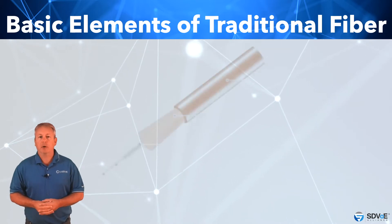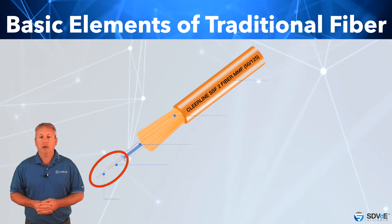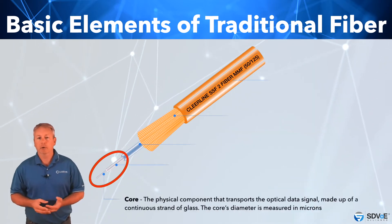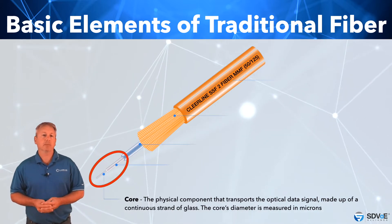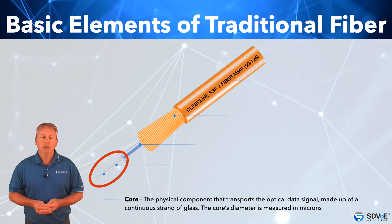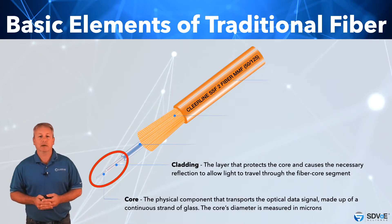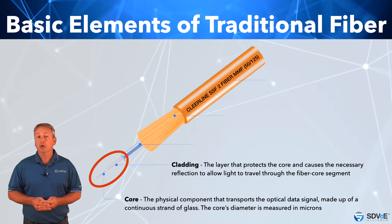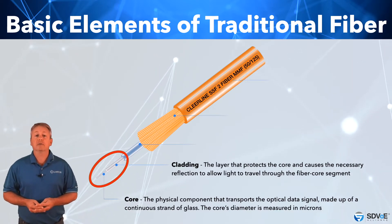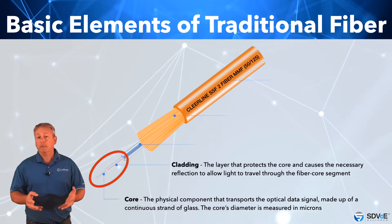At ground level, Fibre Optic cables are comprised of two elements: an inner glass core and a glass cladding layer around it. The optical core is the light-carrying element at the centre of the fibre, made up of ultra-pure glass via a high temperature process. The cladding layer surrounding the core is made of pure silica and has a slightly lower index of refraction — less dense than the core — which causes light to reflect when encountering the cladding and remain trapped within the core.